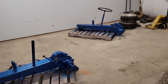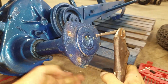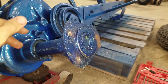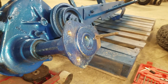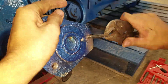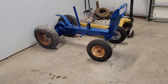I'm going to get this Suburban 725 put together and then we'll do a time lapse on the Suburban 600. I snapped off one of the bolts that hold the tires on, so this is me trying to get that broken bolt out. These tractors sat outside for who knows how long without any rear tires on them, so these threaded holes just sat in the mud the entire time. They were very rusty - I should have tried threading something in there first, but I just rammed the bolt in and broke it off. Luckily I was able to get it fixed.